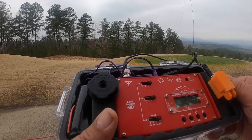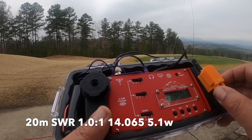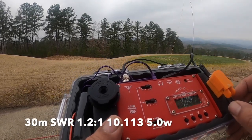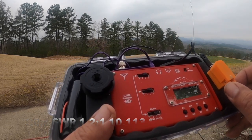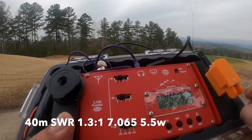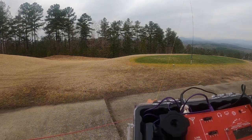Turn the radio on. Check the SWR on 20 meters — 1.0 to 1, output is 5.1 watts. Let's go to 30 meters. We're on 10.113, checking SWR — SWR is 1.2, and output is 5 watts. Let's go to 40 meters. We're at 7.065, SWR is 1.3, and the output is 5.5 watts. And we're ready to rock and roll, ready to operate.